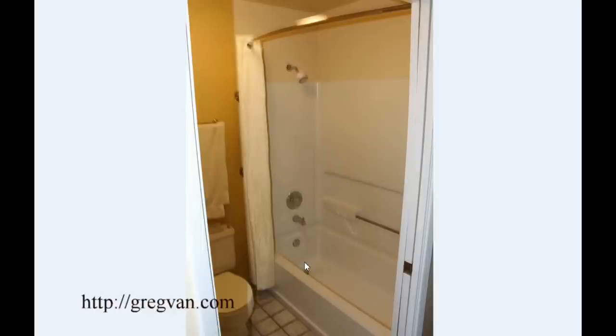This is an acrylic tub with a three-piece panel. You have the tub, you have a panel, another panel, and then on the opposite side you have a panel — and these are great for remodeling. If you're remodeling a home, you can actually get all these pieces through the door. If you just had a one-piece tub, you'd have to take the toilet out, probably the door out, the door frame out. They're hard to get in.